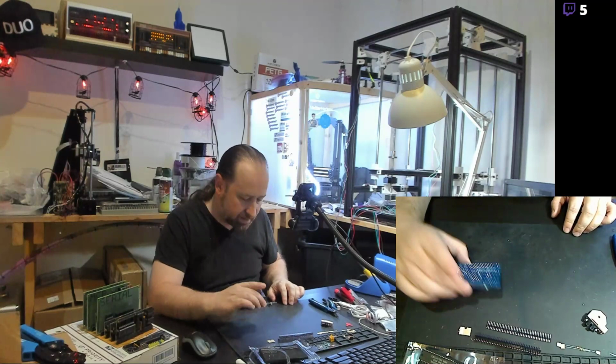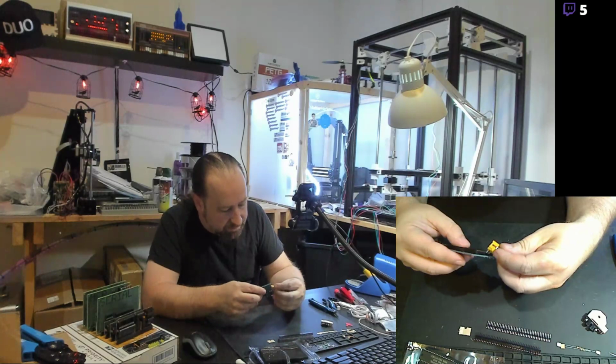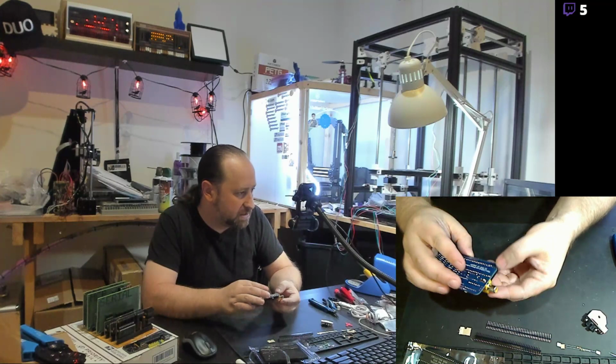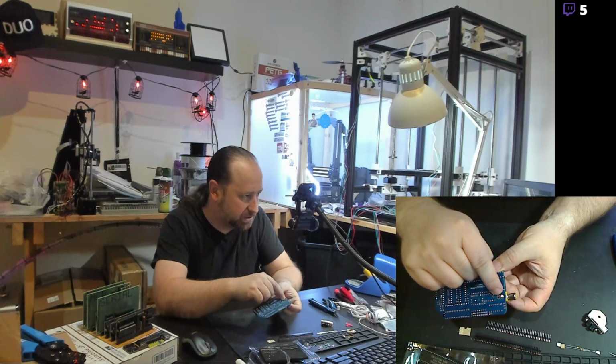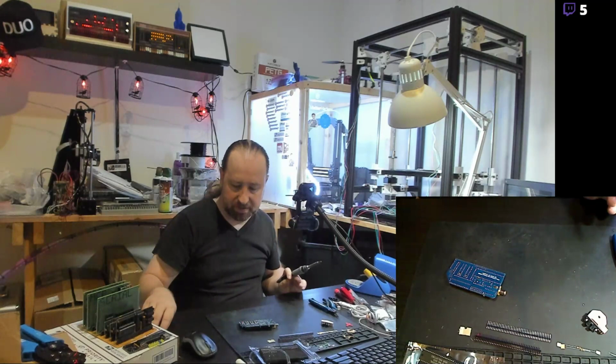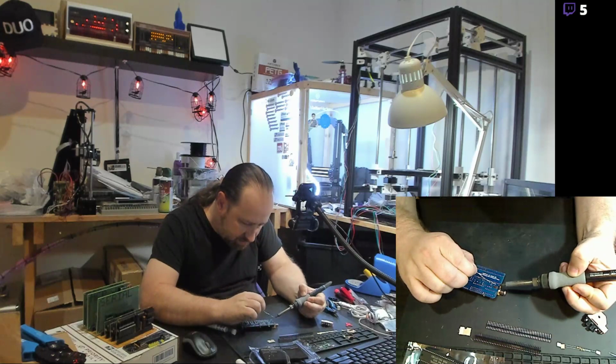Okay, so let's see. Actually, I can probably get the video out port mounted on and get that soldered up. And it fits in there just like that. It's got bent pins on it that help retain it in the socket, and they're very large pins with very large holes for mechanical retention. Definitely a lot of mechanical support in that. At least there will be when I get some solder into it. And I'll go ahead and clean the end off of that.